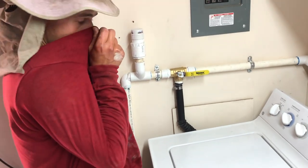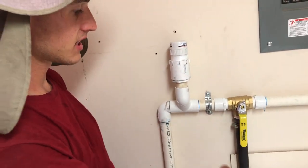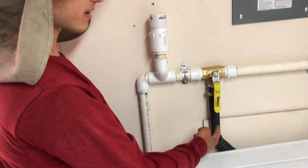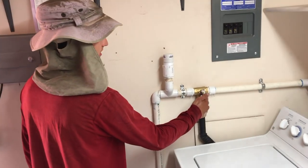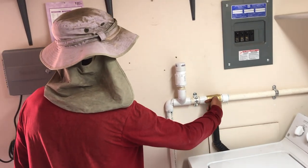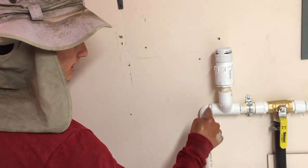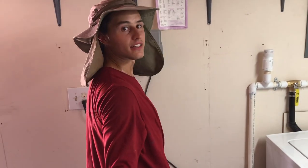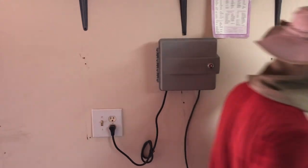Gray water is any water that humans have touched. When I switch this to the down position, this is the pipe that every washing machine has — a drain pipe that usually goes into the sewer. We put it into a T, making it a three-port valve. There's an air vent right here to make sure it doesn't suck back into the machine, then it goes down and out the wall into the soil and to the trees.